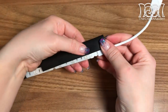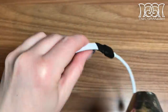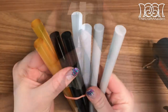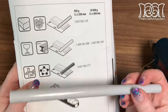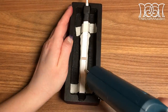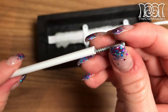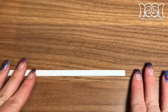To avoid the connection between the cord and the strip from separating I'm adding another black heat shrink tube. Now for the assembling — I've marked out where the LEDs are so I know how to place it, and to keep it still I'm using masking tape. There are many different kinds of hot glue made for different uses; looking in the instruction book that came with my glue gun I'm using the grey one as it's supposed to be used for cords and such. To really make sure the LED strip wouldn't come loose I added plastic retainers made from a plastic tube big enough for a screw to fit in, scored and broken to length, then glued onto a piece of plastic card with polycement.